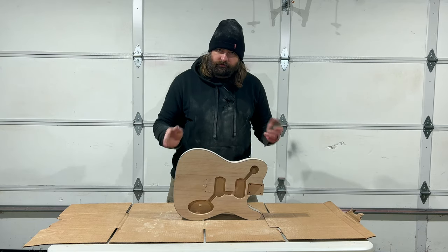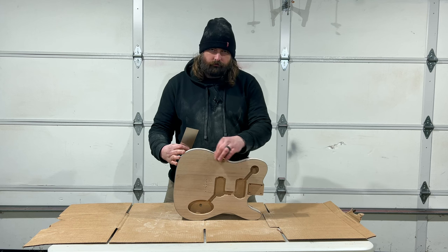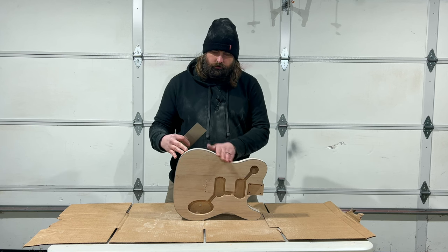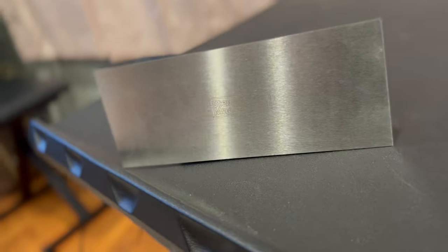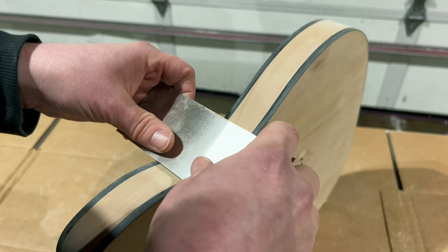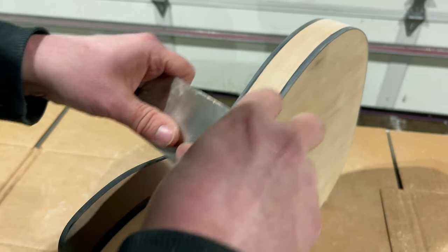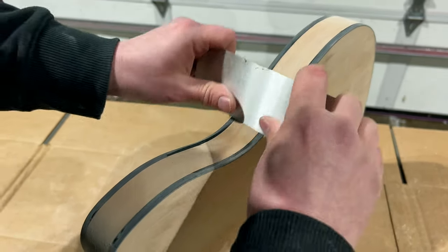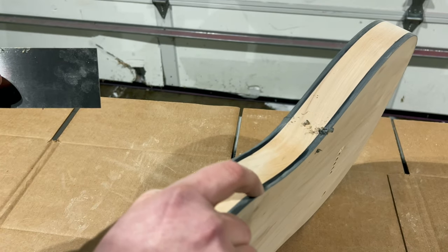Now that this is really nice and glassy smooth, you need to scrape the sides and the top of where the binding is so it has a nice shiny appearance again instead of that dull sanded look. To do that I'm using this large rectangular scraper from StewMac — link is in the description. You put it down at about a 45 to 60 degree angle, press your thumbs on the inside, push, and repeat until the binding starts to scrape a thin layer off and you get that shininess back.